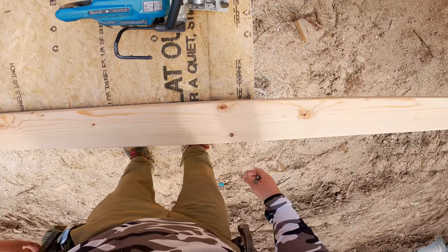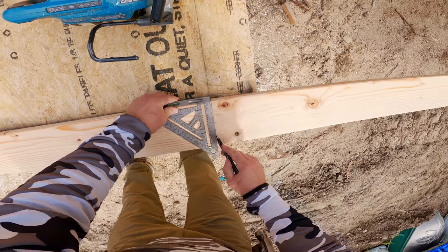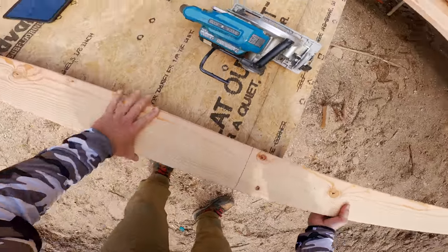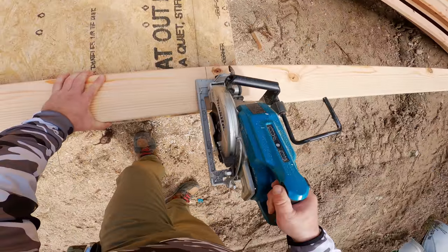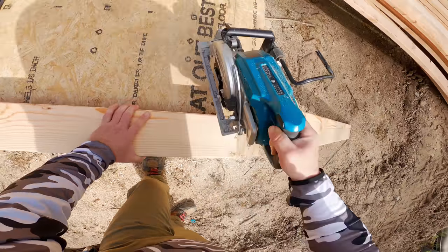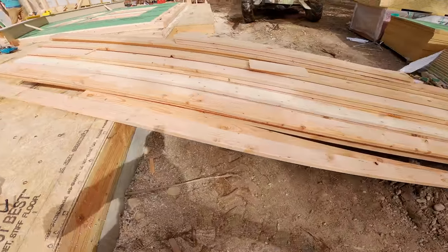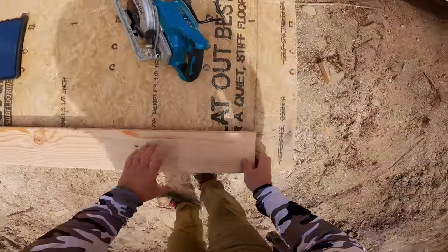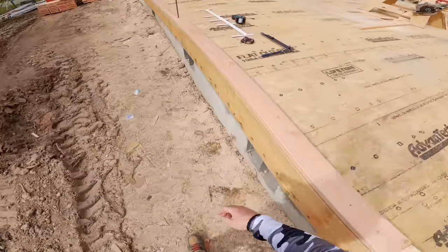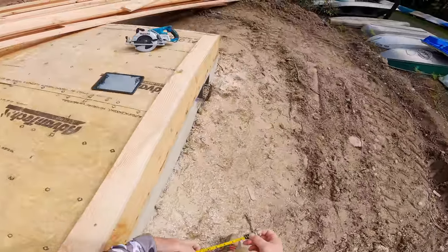Now normally when I frame a rake wall, I frame it from outside to outside. In this case, I decided to frame it 5.5 short because the wall that intersects this, we had already framed standard height and set off to the side. Essentially what we like to do is build walls where we have room, go move them, then build the biggest wall, lift it, and then the other walls are ready to drop into place, and that just shortens some of the bracing. So 5.5 inches short, then I use 16 foot material because it tends to be a little straighter. It's never perfect, that's okay.